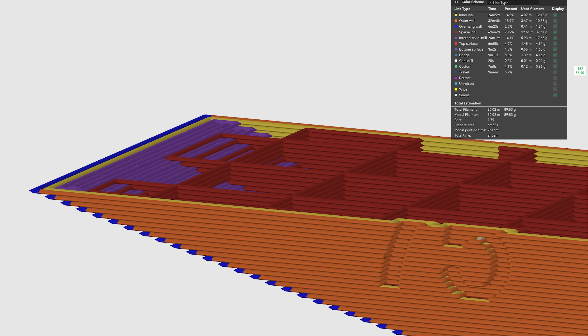Neither of them really print well at these extreme angles — they print okay, but it's more of a trick, like a speed benchy thing. In the speed benchy tests it's not like a good-looking print; it's just technically a benchy printed very fast. Neither of them can print a 75 degree overhang where you'd look at the part and say 'yeah, that's good quality.' These are very extreme overhangs — with a 0.4 millimeter nozzle and 0.2 millimeter layer height it gets to the point where it's just hanging out in air, and neither of them are going to perfectly cool it into a rigid shelf you can expect to support another layer on top of. It's just geometry at this point.